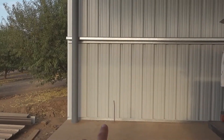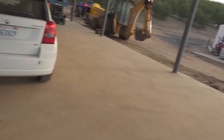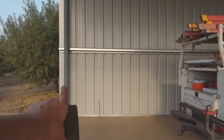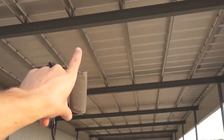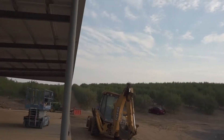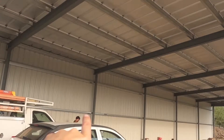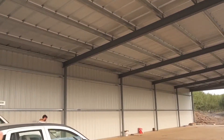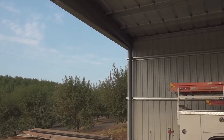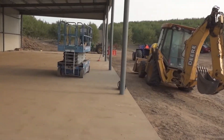Just to give you a scope of things: we're going to have a panel sitting here, we've got an underground feed that goes over to where you see the 600 amp disconnect. From that panel we'll run conduit overhead, we'll have some lights down the middle of the room, some security lighting - wall packs out on the face of the shop - and then column plugs for convenience outlets and receptacles so the farmer has places to plug in chargers and cords. Also some light switches here in the front.